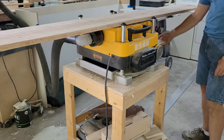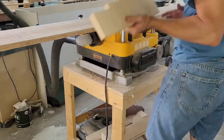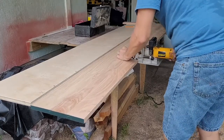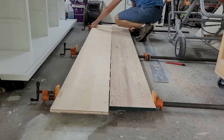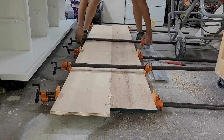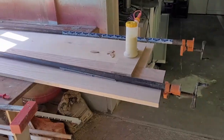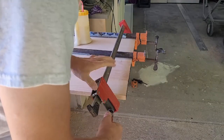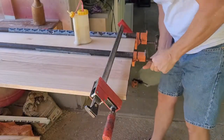I made a point to keep this piece long in case anything went sideways — which, surprisingly, it did not. After adjusting the depth of cut on my biscuit joiner, I cut the slots to attach my solid oak sections to the plywood mate, again using 8-inch spacing. With that done, it was glue, biscuit, and clamp as before. Once the two large pieces were glued together, I added the little cheater piece, also prepared with biscuit slots. I connected two pieces of three-quarter inch pipe together to make a clamp long enough, then added a parallel clamp to pull in the other side.